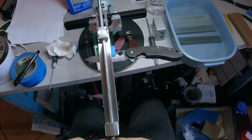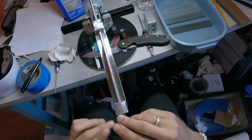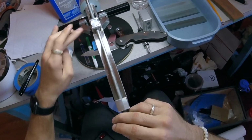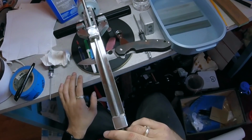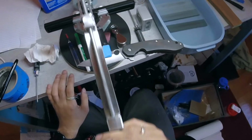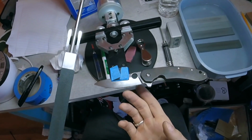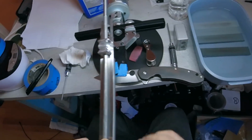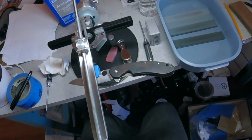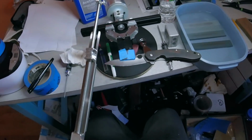And yes, in early sharpening stages, when you haven't even apexed, you can give it the weight of your hand. See, it is wiggling my sharpener a little bit, but we'll get that out later. So give it a little bit, maybe do your circles. Get some work done. You know what I mean? That's okay. But once you've apexed, or if you're trying to hit the tip, or if you're trying to fix here, you're not pushing hard, okay? You're never pushing. That just needs to be clear.